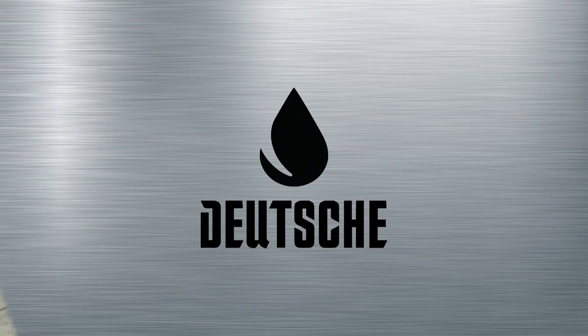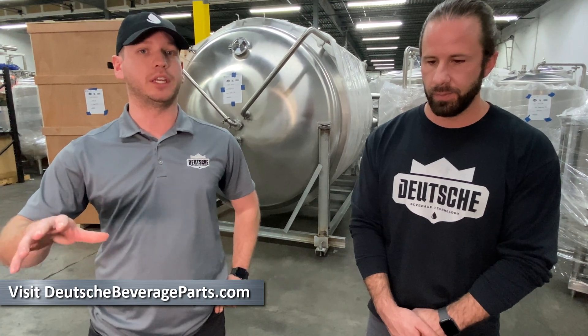As Zach mentioned, this is an iterative process. In this scenario we were dealing with a pump spring that was a little too tight and had a squealing issue. You're going to start by backing it up an eighth of an inch, then recheck — rerun the pump. If it still has that squealing issue, back it up another eighth of an inch and see if you find that goldilocks zone. You know you've gone too far if your pump starts leaking, and vice versa — if you started with a leaky pump, you know you've gone too far the other way if the pump starts squealing again.